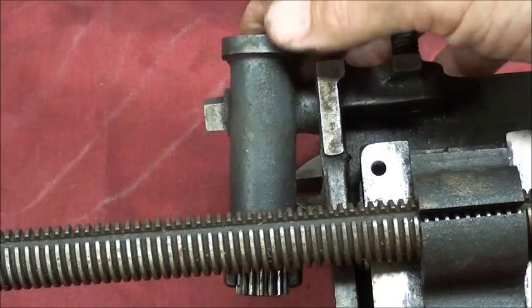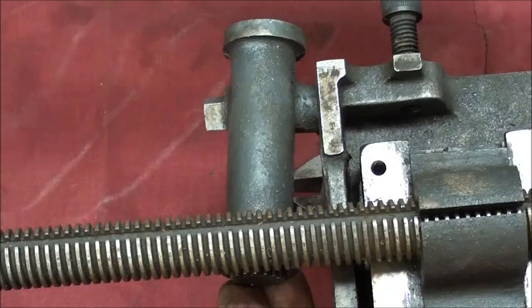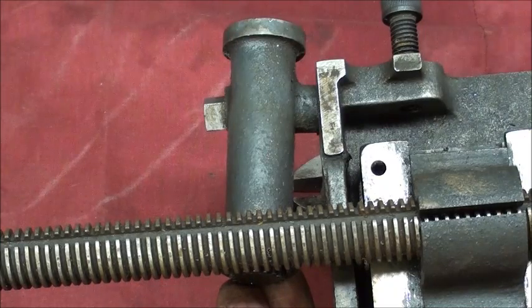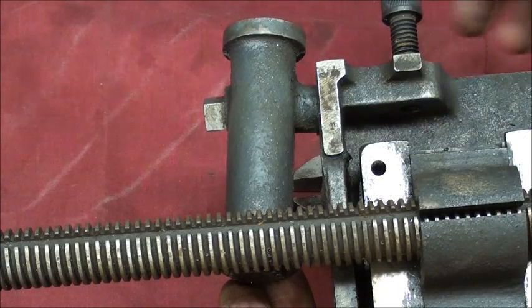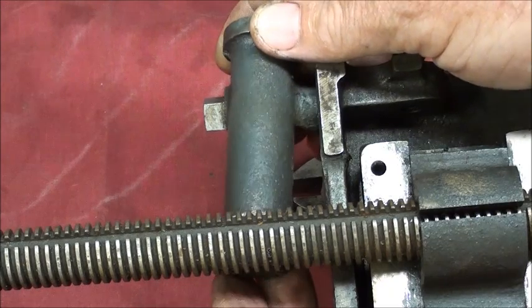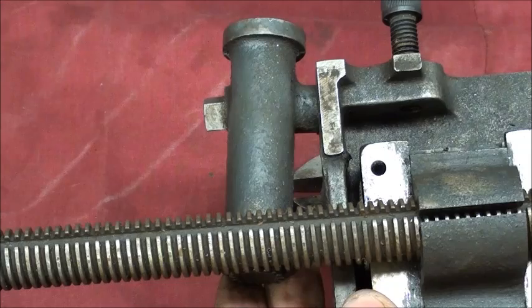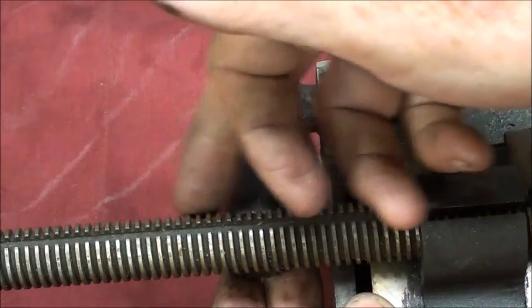Have you noticed on this thread chasing dial it seems like they misdrilled it — it's at a bit of an angle? The purpose of that is to match the gear with the helix angle of the thread on this Acme thread, so that's intentional.